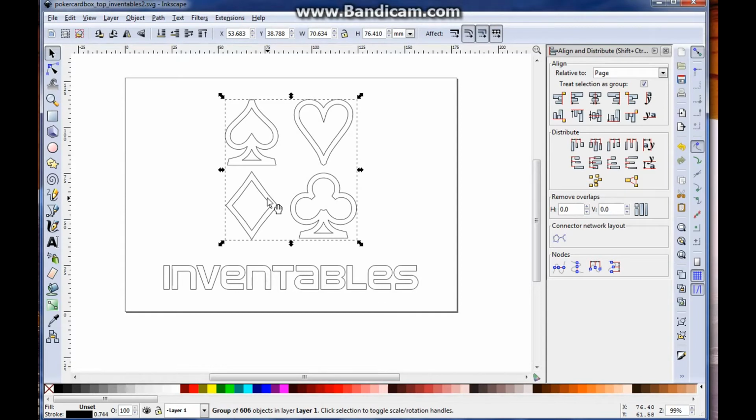The really nice thing that you can do now is by clicking this, it gives me the XY coordinate of this lower bottom left coordinate of this part that it's going to cut out, this V carving. And that's really important because the G code that it exported cuts from this point.